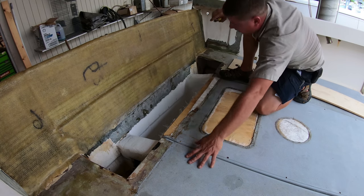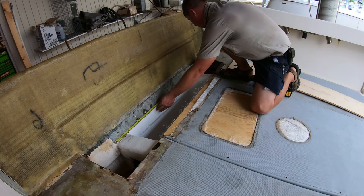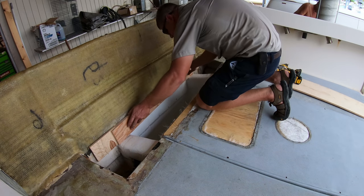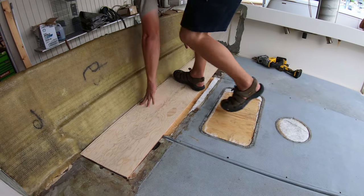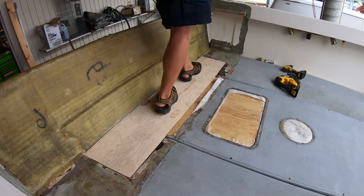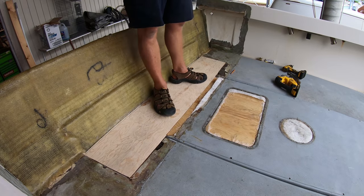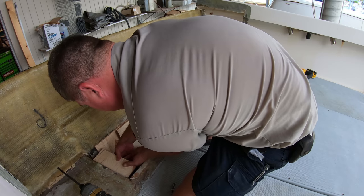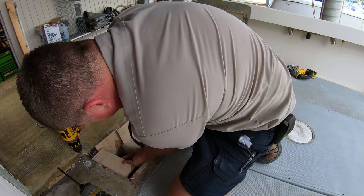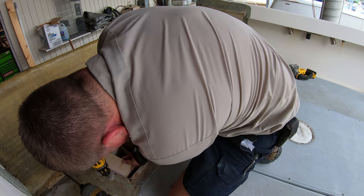The next thing we need to do is cut out some supports for both of the sides and the back. The support in the back is going to rest directly on the stringers and since we didn't have a long enough piece of wood left over to double it up, we just cut two spacer pieces to push the support out a little bit to give the floor a solid support in the back. We had to notch out the spacers, the support piece, and the floor to get everything to fit together and level with the existing floor. With the back supported and our floor fitting in nicely, we just needed to add the side supports. For the sides we just used some more square scrap pieces of plywood and screwed those up to the bottom of the existing deck with pre-drilled holes.